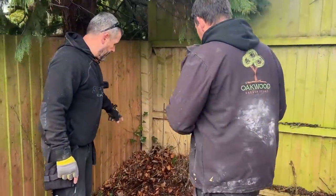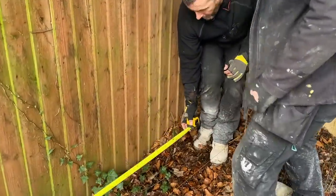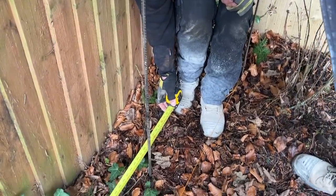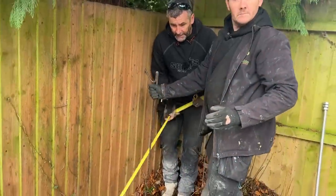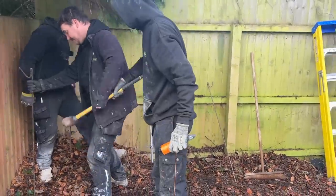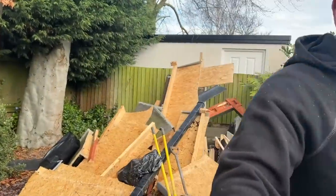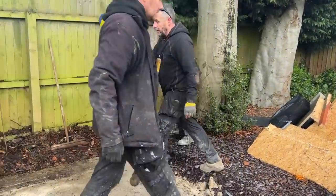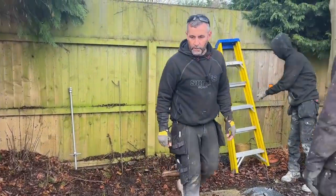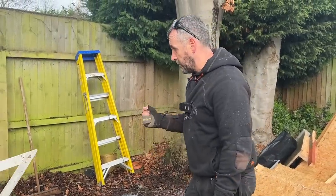He's going to do exactly the same here now. I'll get a tape measure on there — I'm going to hook it on that rod and what we want is 5.1 metres or thereabouts, and that will allow us to have a five metre room internally. He's got his back line, his side line, this other side line, and then he'll do the front elevation. It's a bit backwards this one, because normally this would be the front of the building, but the bifold doors will be on that side, so there'll be a window here, and here there'll be a door into the storeroom.